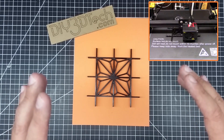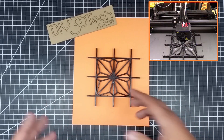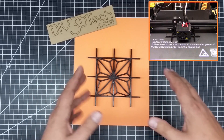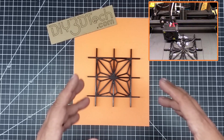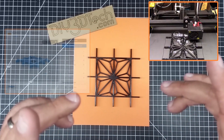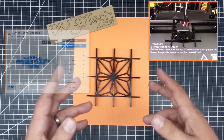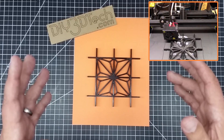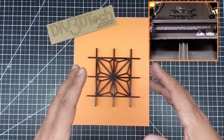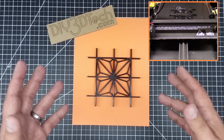One of the things I noticed is that a 0.6 nozzle probably wasn't the best selection for this because these are three millimeters wide. I could have gone up a little bit more on the retraction, so you'll notice a little bit of stringing. I cleaned it up a little bit but it needs more cleanup. I've packed away my heat gun because I am moving shops — more to come on that in a future episode. I did want to share this with you guys because it will be out on Thingiverse. I've got the STL out there and the SVG out there. I'm probably running a time-lapse of me printing this on the CR10 in the corner. It took about an hour and a half with the 0.6 nozzle at about 60 millimeters per second.